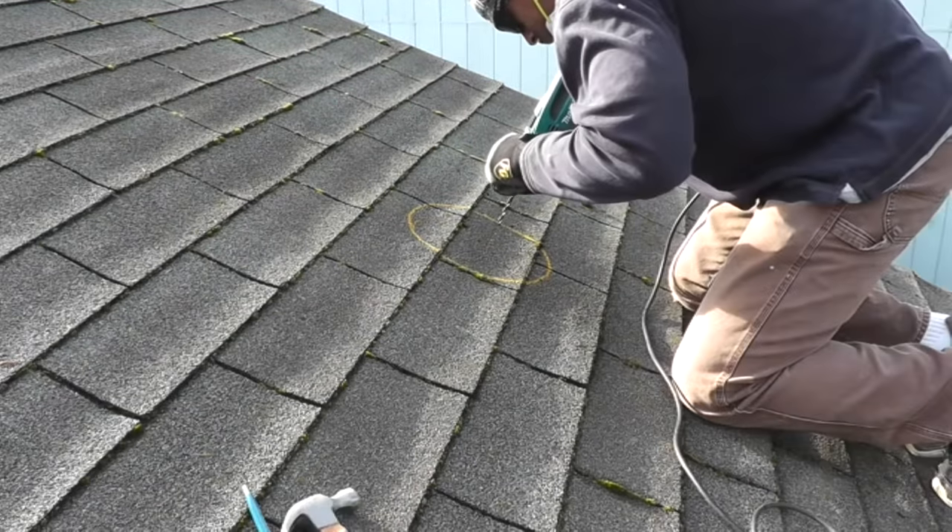Here are the crimpers I used to crimp some of the pipe ends. Once I got everything lined up, I installed three sheet metal screws at every joint spread out equidistant from each other. To complete the installation, I wrapped two turns of metal foil tape around each joint.